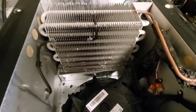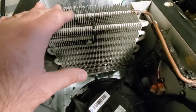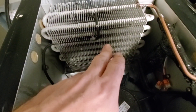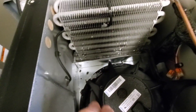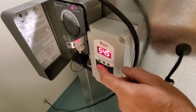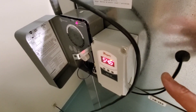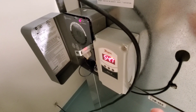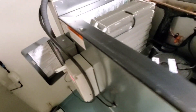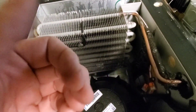I pulled this cover off to expose the evaporator and make sure it was free and clear of ice, which it is. I've discovered they have implemented heaters as well as hot gas bypass. The Dwyer controller has two set points: one is for the heaters and one is for hot gas, and it kicks those out once it's hit the set point. Now that we've defrosted, we're going to start it back up in refrigeration mode and see if we can get down to temperature.